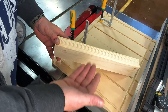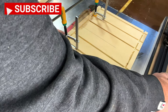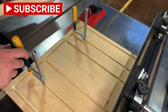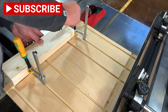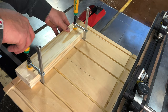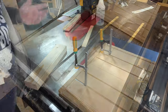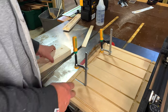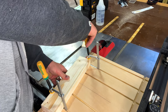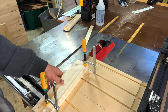For this example, I want to joint this two-by-four. We're going to push our jig up against the blade, then push the fence up against the jig and tighten it down. Then we pull the jig out so we can place our workpiece in — we place the two-by-four on the jig so the edge is just a little bit proud of the jig. Once we're comfortable with the setting, it's time to make the cut. For the tapering, it's almost the exact same process — all you have to do is figure out the angle you want and lock down your workpiece.